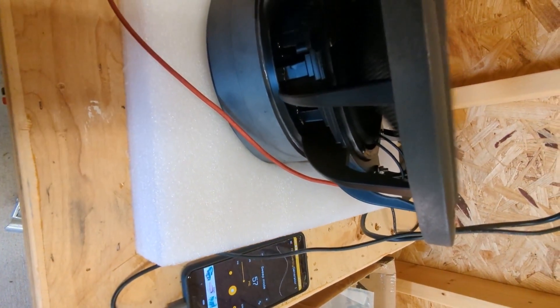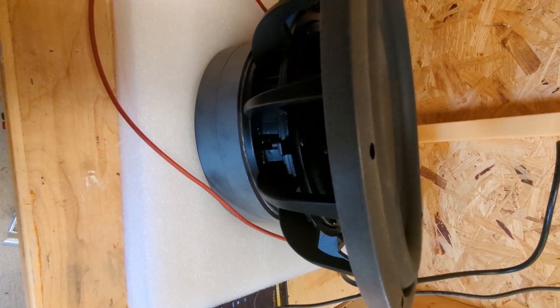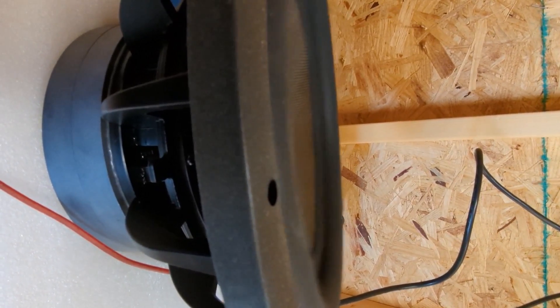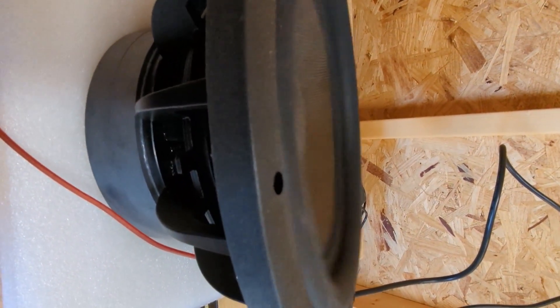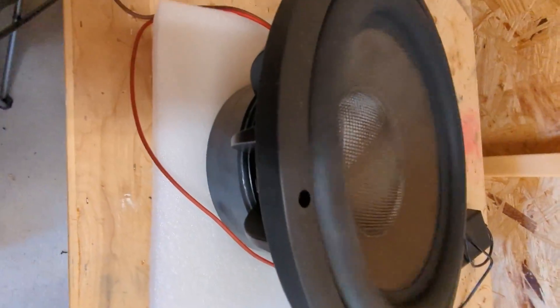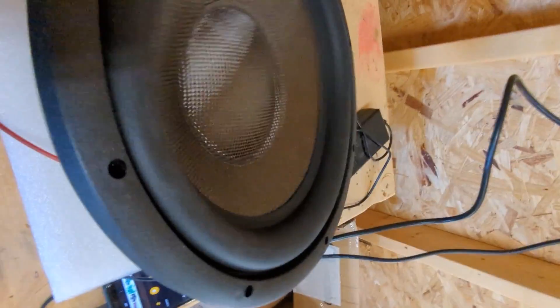Check this out — you can see in this shot that the subwoofer cone looks kind of wobbly. It's not actually wobbling; all of that is due to the CMOS sensor in the camera, known as shutter roll or the rolling shutter effect. Digital cameras don't just open and close the shutter like old film cameras — instead the sensor scans the image, usually top to bottom or right to left. The subwoofer is playing at just the right frequency so that it's in a different position at the beginning and end of that scan. If you played at different frequencies or turned the camera sideways, the wobbling effect would change. And of course, if it actually were wobbling that much, the voice coil would rub against the gap and something would break.